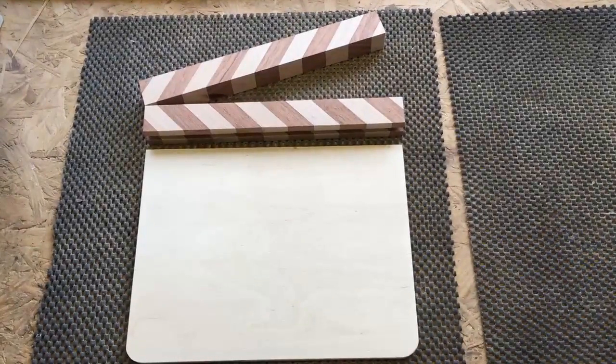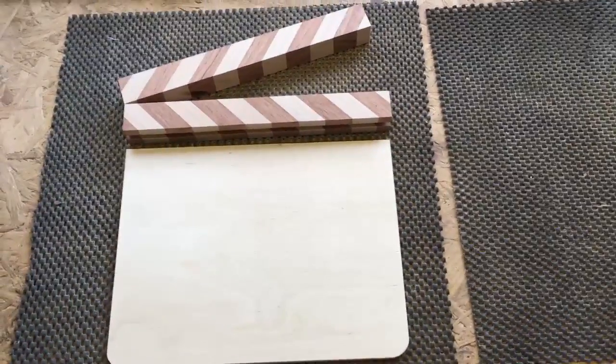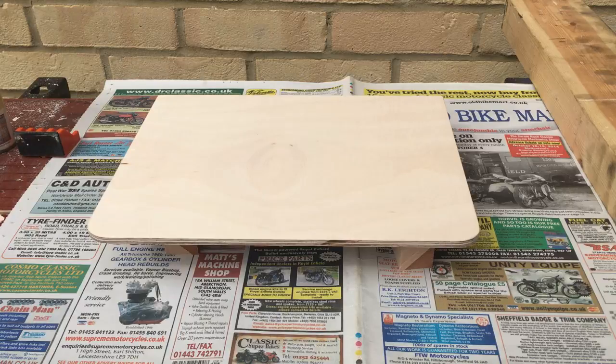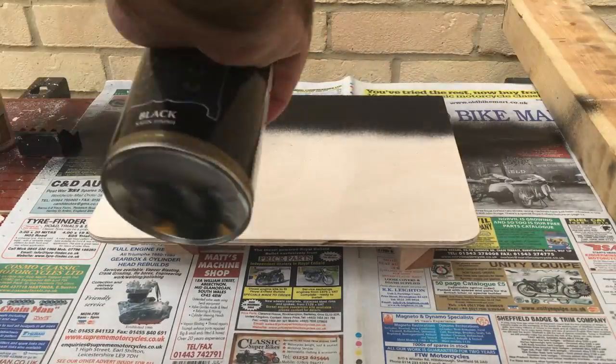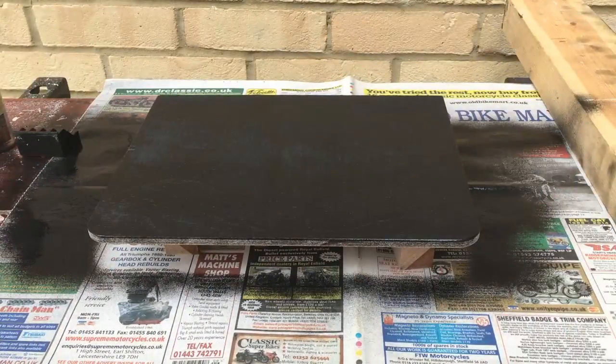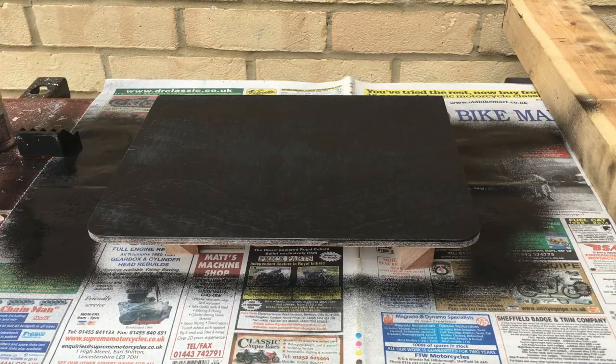That's all the parts of our clapperboard finished. We're just going to give them a very light sanding and then they'll be ready for some finish. The trick to any kind of spraying is to use thin even coats and to keep the same distance away from your workpiece at all times. Travel across it from one side to the other in a smooth motion, don't spray in one spot for any length of time, and don't try to put too much on to start with. Just build it up gradually in small layers and you'll get a much better finish. Let that dry and then come back and do another layer in small layers and you won't get any drips or runs.